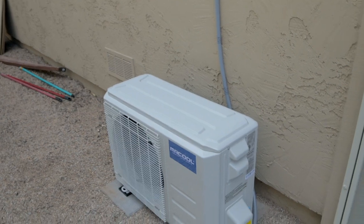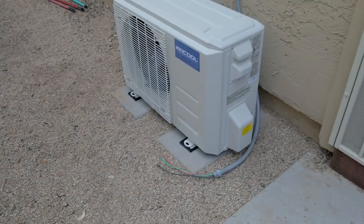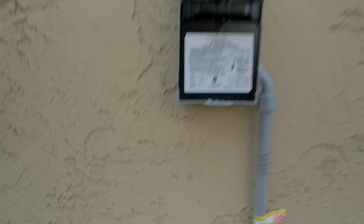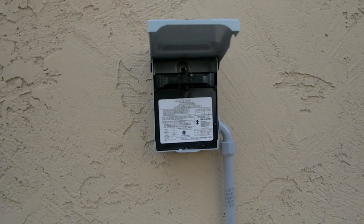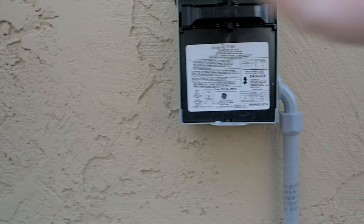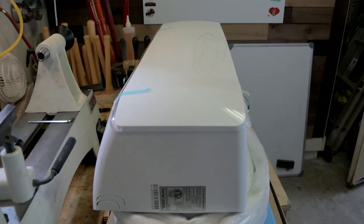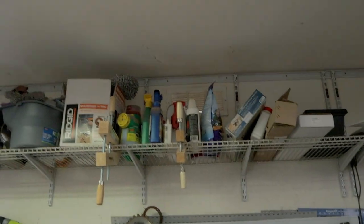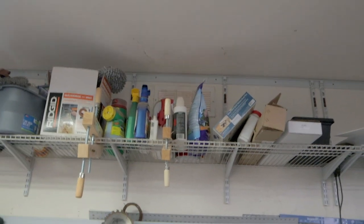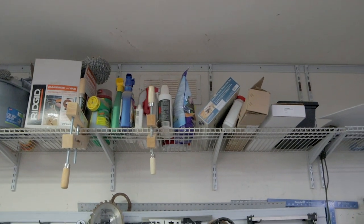I just wanted to give you a tour of where things are going and what the situation is like. This is the outdoor unit — I've just got it set on some pavers. The electrical still hasn't been run to the unit, but here is a disconnect. I'll put parts links down in the description. This is a 20-amp disconnect, as required by this 18,000 BTU unit. Moving inside, this is the blower air handler, and it's going to go up here, roughly over where that outside unit is. I've got to take that shelf down, and there's a template that goes up.